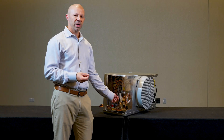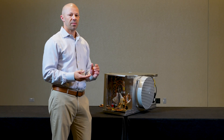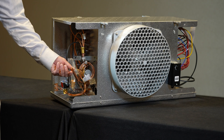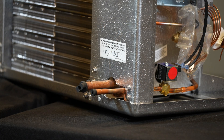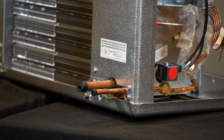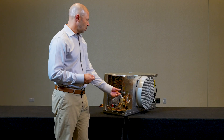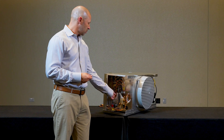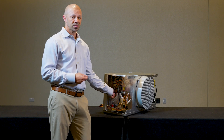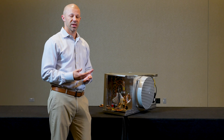As you can see, it is pre-installed here but is not preset. So there are two things you need to do. One is this bulb needs to be attached to the suction side of the unit cooler. Once that is attached, there is also an equalizer line that is tapped in to that same point on the system. Those are your pressure and temperature readings of the valve.